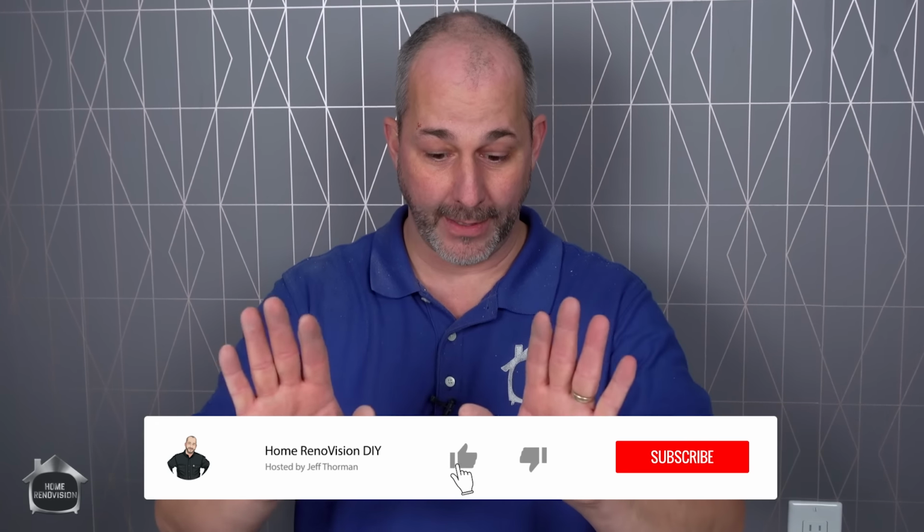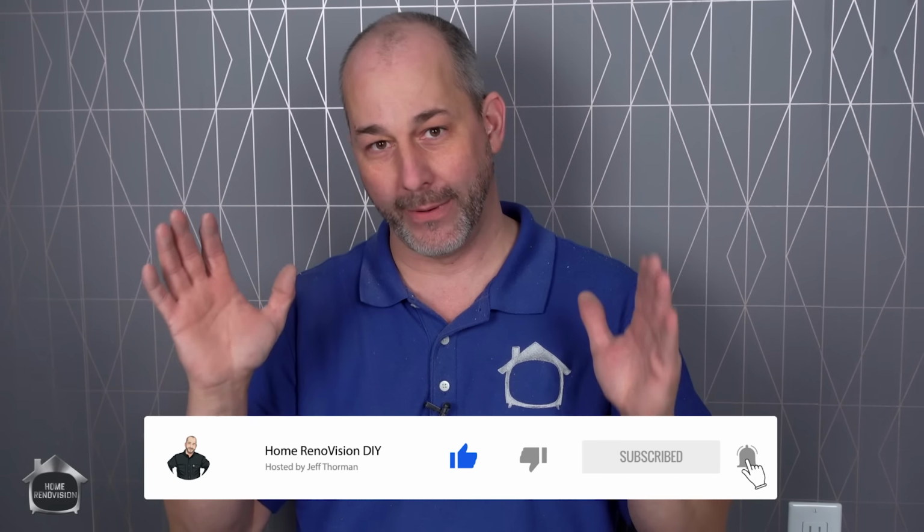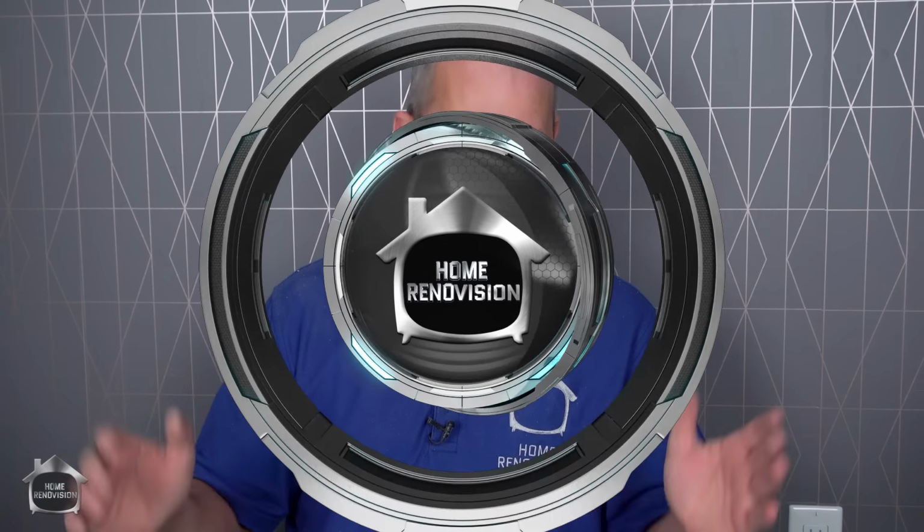If you have them all stacked like this and cut all the tops off, you're going to have to invert, and you'll end up with them upside down and your holes will be out of alignment. So take extra caution, think through your process, make sure you're not messing that up. What I do is I stack them, all the finished edges facing me, holes up, holes down, holes up, holes down, and then I make my cuts. That way I'm confident I'm always cutting the top off and not causing myself an issue.